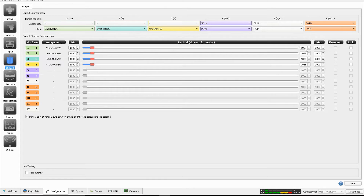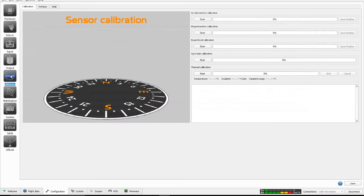Right now in our case it's 1035 — this should be set by yourself to the point where the motors are spinning continuously without hesitation or hiccups, and a few points more, because in the air the prop can stall and it's better to have more authority in the lower section too.